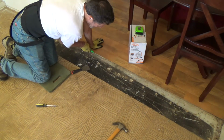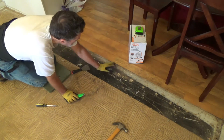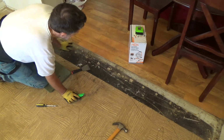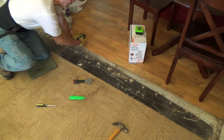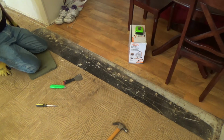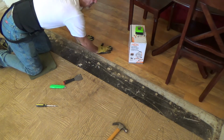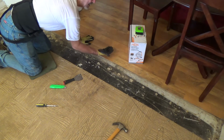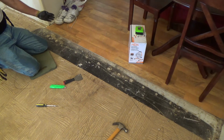And it looks like they put a thin foam layer sheeting underneath this to catch any moisture that's coming up from the subfloor, let's say. Because if you get moisture underneath a free-floating wood floor like this, it'll expand the wood. And that's why you've got to leave it short at both ends.